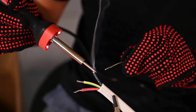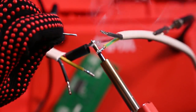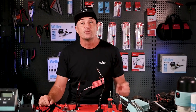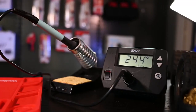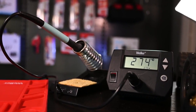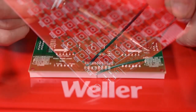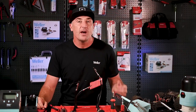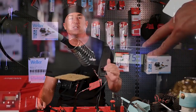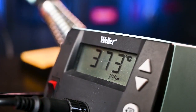Let's have a chat about joining the actual parts. Once you've tinned the tip, you're ready to solder your components together. The techniques you'll use will vary from project to project, but the basic step-by-step instructions are as follows. First, determine the right temperature for your project. Which temperature to use depends on the materials you're joining and the kind of solder you're using. As a general rule of thumb, around 350 to 375 degrees Celsius is a good temperature for most tasks.